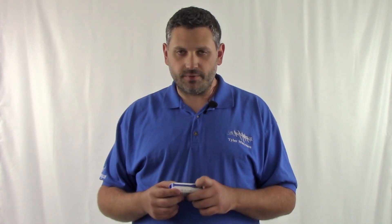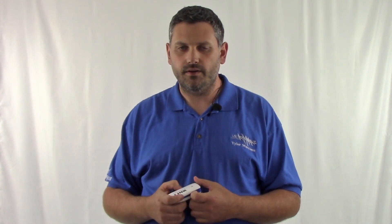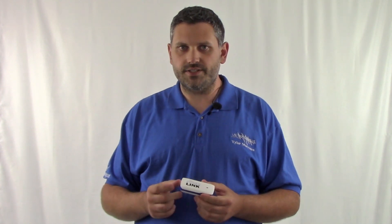Our fifth question is: I have my Wi-Fi turned on on my PowerLink, my device connects, but my device gives up trying to connect due to a DHCP timeout or lack of IP address. By default, the PowerLink is a bridge access point — there is no IP authority. It is assumed that the device on the other side of the PowerLink will hand out IP addressing, or you need to set a static IP address on your computer.